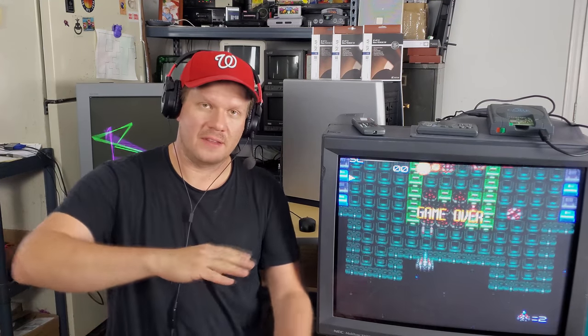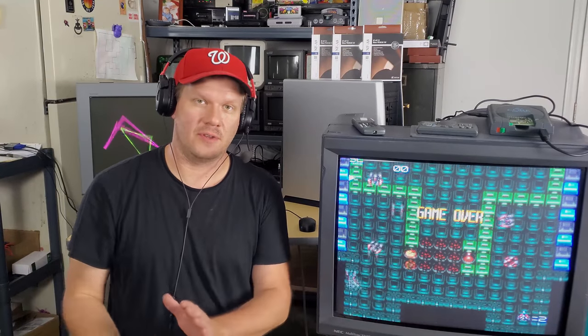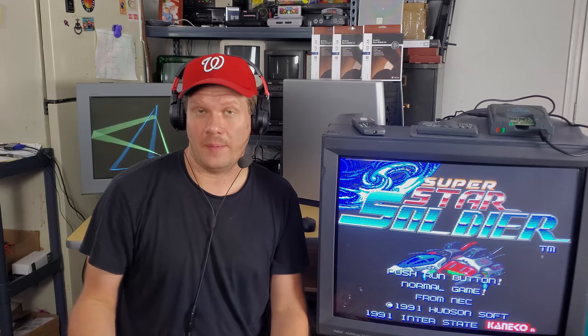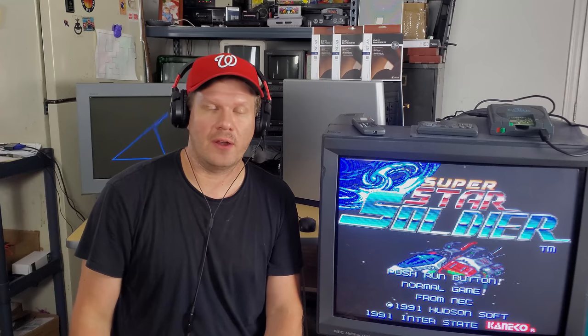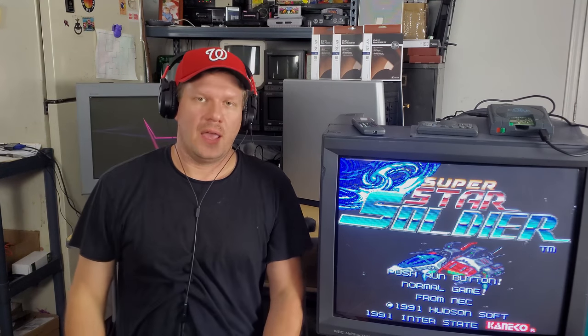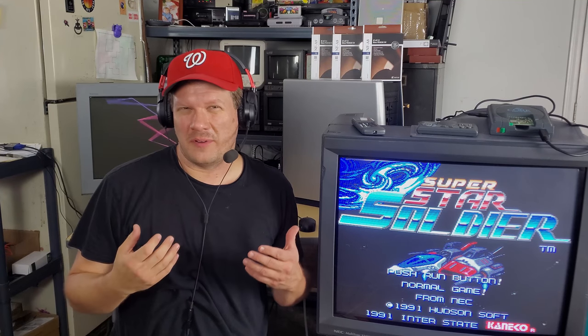You could get around that by adding a dust filter in the back, in front of the fan, so when it sucked things in, you could just have a filter there, and then you clean the filter periodically. So I think that you could still get around that if you wanted to go to the extra step and install a dust filter and then flip the fan around, and that way it's pulling in cool air and exhausting it out the top. And so that would have been probably a little bit of an improvement, I still believe, on this monitor. Now, it's still fine the way it is.